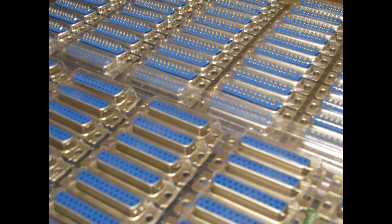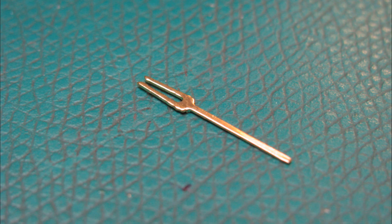What makes a good connector? Along the way we learned a lot about how connectors are made and what the quality differences are between them. One example is the difference in the female contact — there are several styles that come in at different price points. The fork style is the cheapest by far, and we found that it makes a very unreliable connection over time. Even when new, the failure rate is very high. While cheap, fork-style contacts were completely unsuitable for Amiga video connectors.